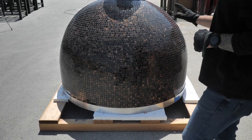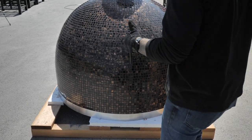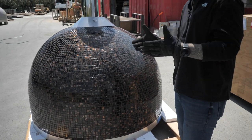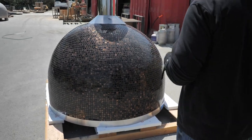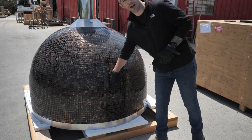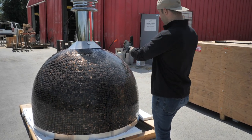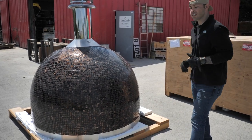Whether you're installing this oven on a stand or a countertop, it's very important that you center up your forklift directly with the center of the back of the oven. That's going to make life a lot easier when it comes to setting it down. You do that by eye — the middle of the pallet should be the middle of the oven. Get a clean center pick with forks not shifted left or right.